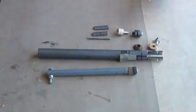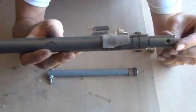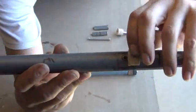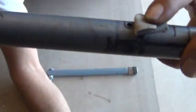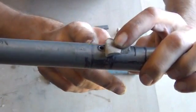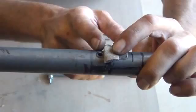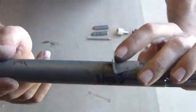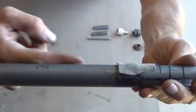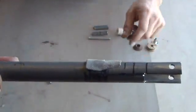For the one-way valves on the pump housing itself, there's a very simple one-way valve here. It's underneath a leather flap that's just glued onto the metal — there's a drill hole underneath it. This would be the bottom edge of the piston at the very bottom of its downstroke, leaving a little gap. That flap will open up and release pressure on the downstroke, then close back up on the upstroke and allow the vacuum stroke to work.